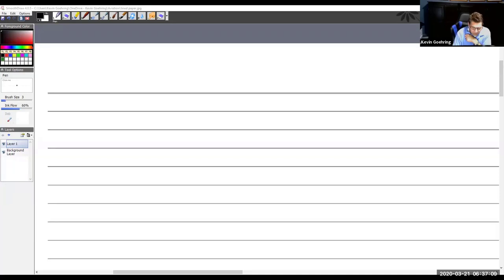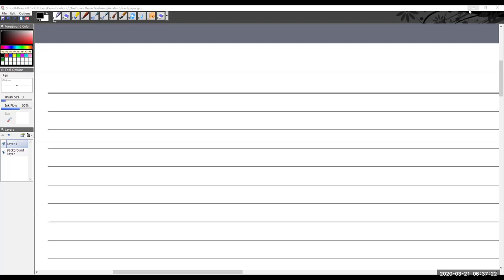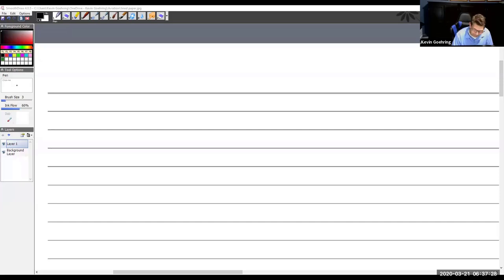So a little bit of business from yesterday. Harriet asked about the Reid vapor pressure. And for avgas, it is actually 5.5 to 7.0 PSI at exactly 100 pounds. I'm sorry, 100 degrees Fahrenheit. 100 degrees. So that was the correct notation. 5.5 to 7 at 100 degrees. That will not be on the test. So, all right. So I got that.